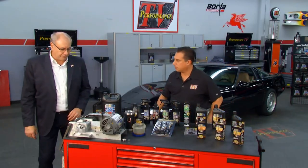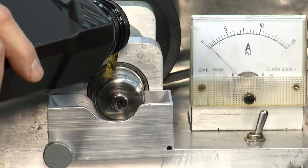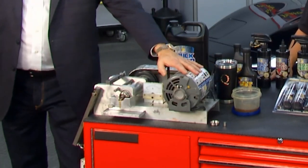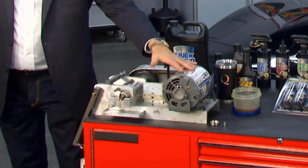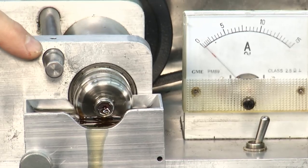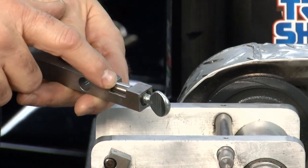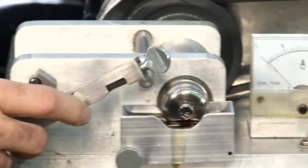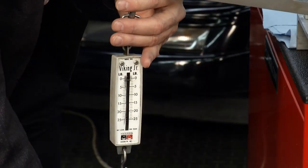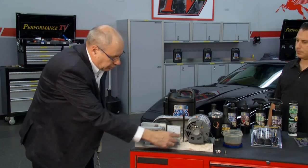We're going to take some standard 15W-40 diesel engine oil and put it in the reservoir. This is a Timken OK load test — it's the standard for testing heat and friction. It uses two surfaces: one is a Timken race with a Rockwell hardness of C62, and the other surface is in the holder — it's a Felix tapered test roll with a Rockwell hardness of C58. Two things to watch are the amp meter, which measures the load on the electric motor, and the scale. Every pound applied on the scale is equivalent to over 30 pounds of pressure point-to-point with the force arm right here.